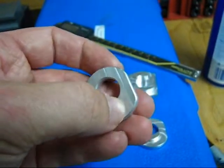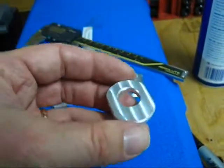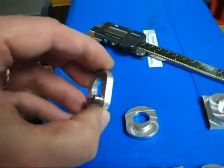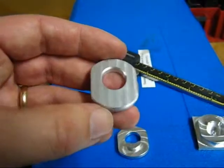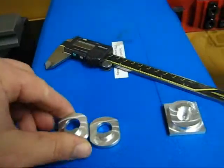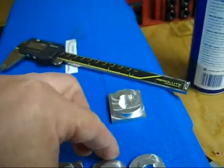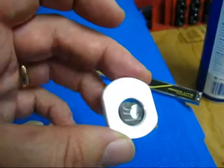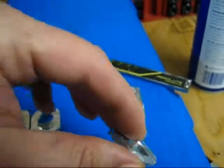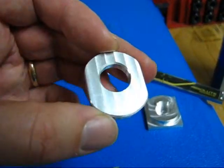Probably a couple thousandths of a step. Some parameters slowed it down a little bit but still didn't get me anywhere. These were the final production-intent prototypes. I reduced the step-over on this one and put the feed rate back up to seven and a half inches per minute. Let's review: this one was 70% step-over at seven and a half inches per minute. This was 70% step-over with 5 inches per minute.